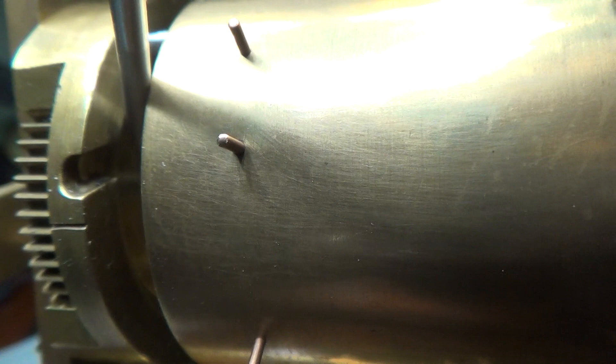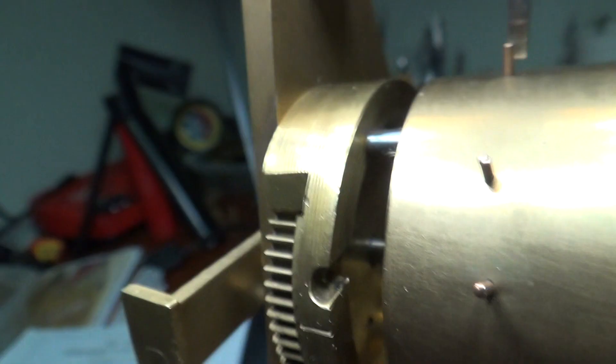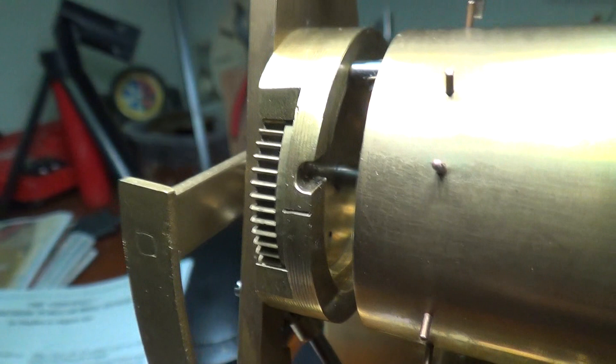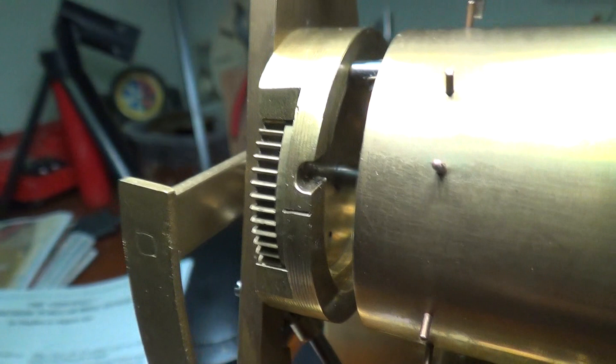The other difference is in the description of this part of the mechanism. The interior is described as having a spiral-shaped groove, and the pin rides in that spiral groove, moving closer and closer to the center, dropping into a hole that allows the shifting to initiate the strike mechanism. I've read his description over and over, and without actually messing around with it, it's still kind of hard to visualize what's going on. But this two-weight movement differs from his description in that this mechanism does not have a spiral groove.